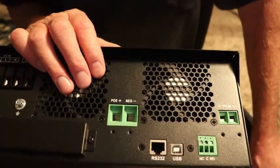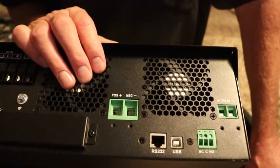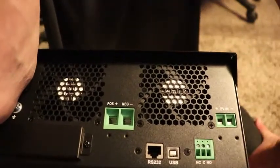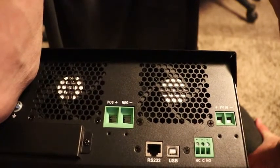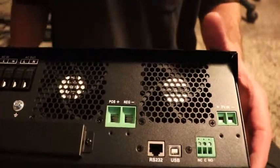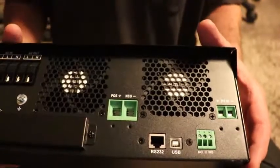I think paralleling two sets of 100-watt 12-volt panels — which output about 17–18 volts DC raw — you'd put two in series and then parallel the four units. If you had eight panels, you would series four sets of two together, then parallel them with a four-way splitter running into one unit, giving you around 36 volts into the inverter.